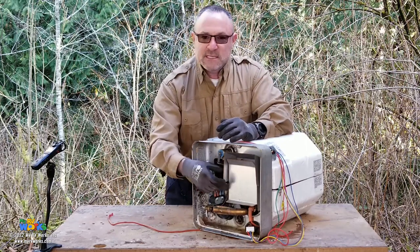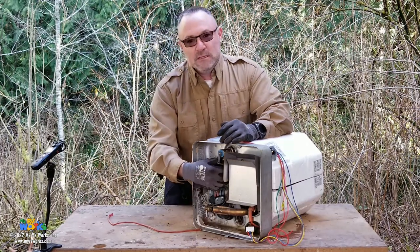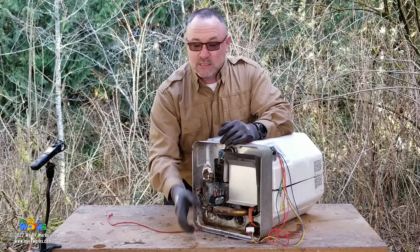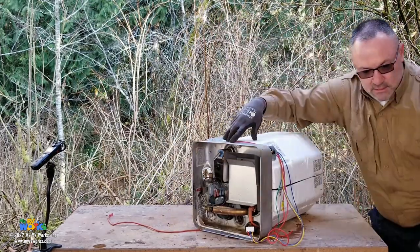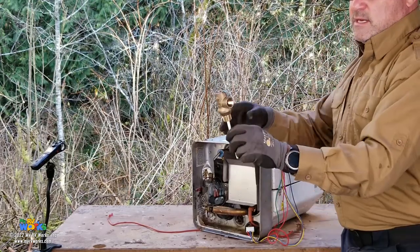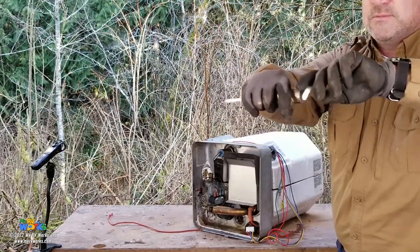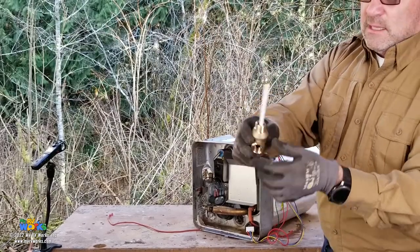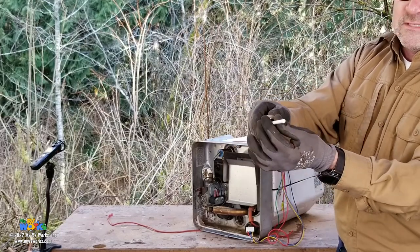If you find that this thing's leaking a lot, you back flush your water heater, you get all the sediment out, because a lot of times these pop-off valves, hold on, stay right there. This right here is what I'm talking about with the pop-off valve. It lifts up a little lever, spring-loaded handle. You can see inside of here that, a lot of times, see, that's supposed to be moving around like it's supposed to. A lot of times these will seize themselves.